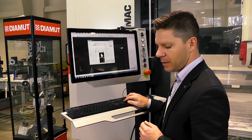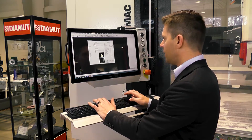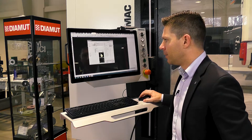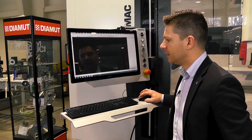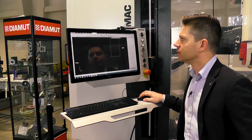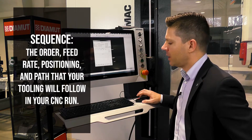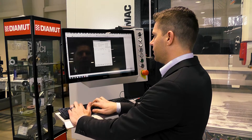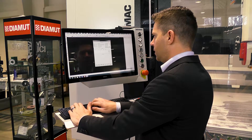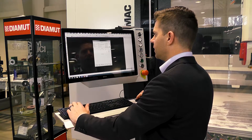I'm going to set the feed rate for this particular tool at 1500 to start, and the RPM at 2800 for position seven as well. Now that we've got the tool settings set up on screen, we're going to power up the machine to start inputting that data into the machine itself. As the machine starts up, I'm also going to create a sequence. After putting in all the tools we still have to create a sequence that those tools will work within. I'll call it T33 R3 FLX series PowerEdge, then T33 R3 P1 through P7, so I know exactly what that sequence is.